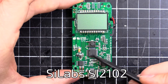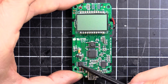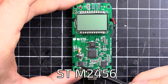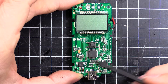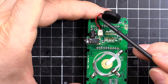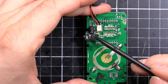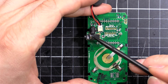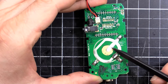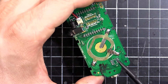The SiLabs chip handles communications, converting the main chip's data to USB. Over here we've got an STMicro M24C256 — it's a 256 kilobit I2C EEPROM, which holds the memory and firmware for the unit. There's a USB port down here, and over the back there's a little beeper that plugs in. There's an inductor here — possibly filtering for the screen or the external temperature input jack, or maybe a power supply component. There's also the battery connector with some soldered metal contacts, and another unpopulated chip on the back of the EEPROM, possibly for expanded memory.